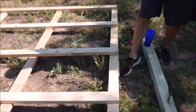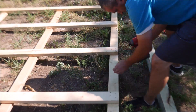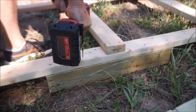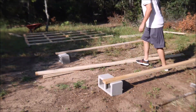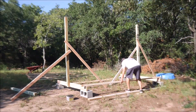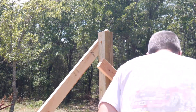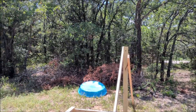One of the benefits of working with wood and screws is it can be easily taken apart, adjusted, or added onto in the future as I see weaknesses come up. You can see I added some pieces of 4x4 to the underside of the rack and secured them with eight long screws — this is the piece that will be bolted to the posts where the whole rack pivots. I had to order the wheels, so I used cinder blocks to build the whole thing on top of so I didn't have to try to lift it later to mount the wheels. I used some spare 2x4s to hold the 4x4 posts in place while I built the structure around them. With the posts in place, I cut them back from 8 feet tall to 5 feet so that the rack and panels would be easier to manage without a ladder — the extra height on a ground mount doesn't really help much anyway.